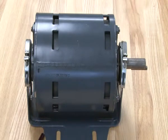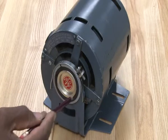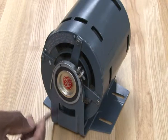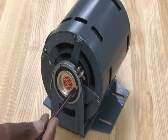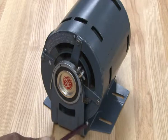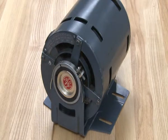This type of motor is called a resilient mounted motor. It has resilient rings around it made out of rubber with a metal ring around it. This motor is supported by the cradle. The resilient rings make the motor very quiet because they absorb the vibration and noise before it sits into the cradle — so the rubber ring supports the motor but also insulates it from vibration and noise.